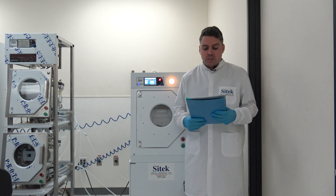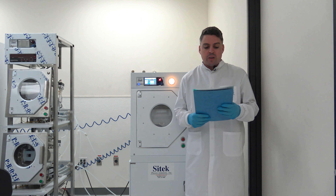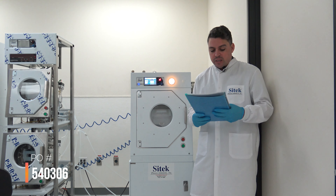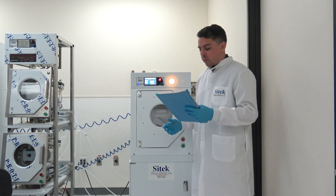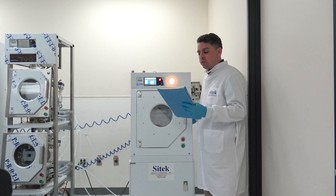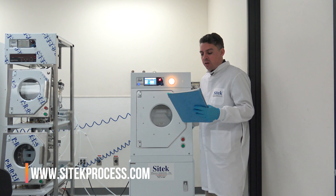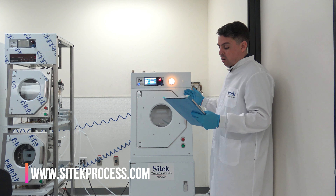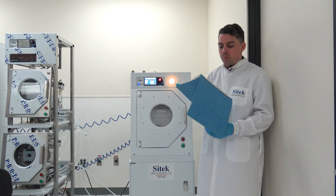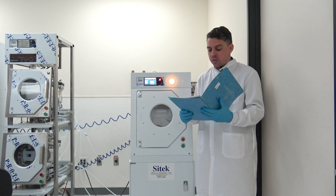This system is shipping out of the United States and our customer's PO is 540306. Looking at our build sheet, we have this system configured with our normal options, which would be a resistivity probe to measure the resistivity of the wastewater. We have DI water recirculation and we have a static eliminator to reduce the static charge and help with particle control on the Spin Rinse Dryer.